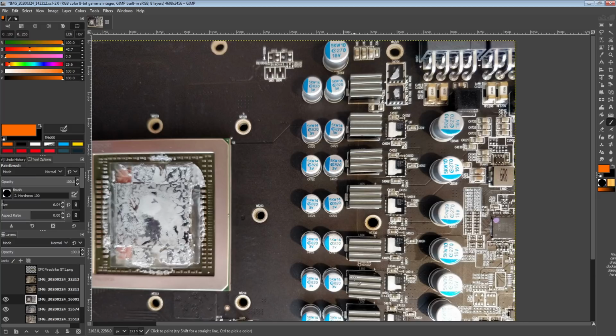So having a better capacitor configuration for Sapphire's ability to sell the card at whatever the stock frequency is has no impact, right? You could probably cut a bunch of these off and it would probably still run just fine. So that's one thing: they're basically going with a really ridiculous capacitor configuration for a GPU. It's not a thing that you regularly see done on GPUs because it gets very expensive depending on how far you decide to take it, and the benefits from it are very minor unless you're pushing massive overclocks.